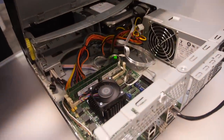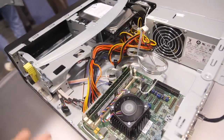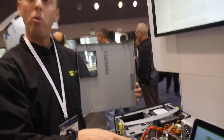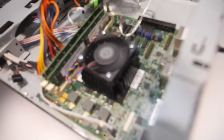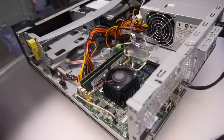Is it fragile? No, I'm just being very careful with a running live server. You need a fan? Well, a small one. You can see this is just a standard small server CPU fan, but we don't have a big loud server fan like you'd have in a data center. This chip uses only 50% of the power and puts out only 50% of the heat that a similar performance x86 board would.